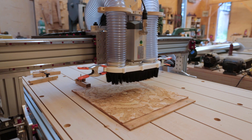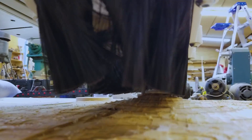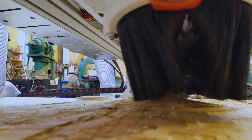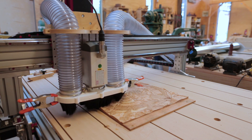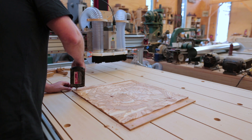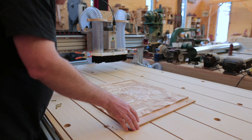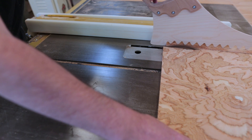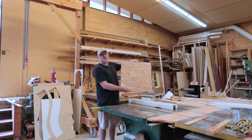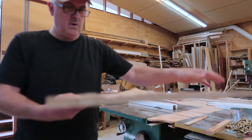So I stopped it and put the brush in place, and this made a huge difference. I see why people use the brush. When this was done there was literally not a single speck of sawdust on the work table — it got everything. The problem is you can't see the bit, or it's very hard to see the bit. So I'm thinking I need to remake the upper piece anyway because it's warping, and I have some ideas of how to make it out of wood. I'd like to play around with different amounts of brush — does it really have to go all the way around? Can there be a window in it, or can it be on one side and not the other? So that'll be for the next part of this project. But I did get a nice terrain of Mount Hood out of this.